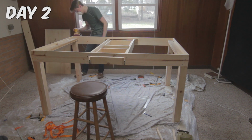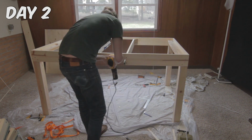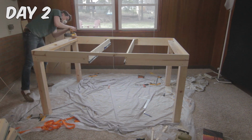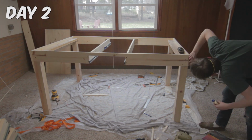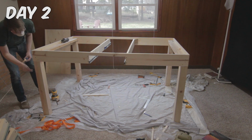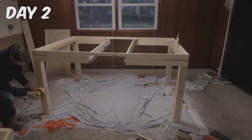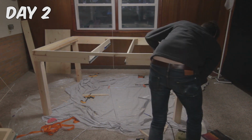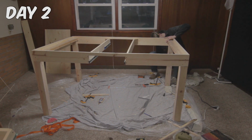After this, I did some sanding and gap filling. My miter saw doesn't cut perfect 45 degree miters, so the corners came out with gaps in them. So I shimmed up the corners with 1-ply balsa wood and a combination of resin and sawdust, and I sanded for nearly an eternity. Wear a face mask, these airborne particles will mess your throat up.